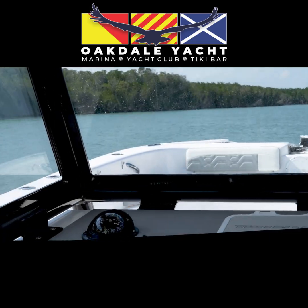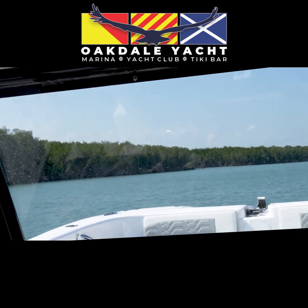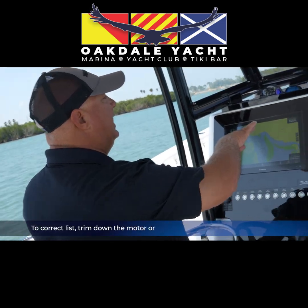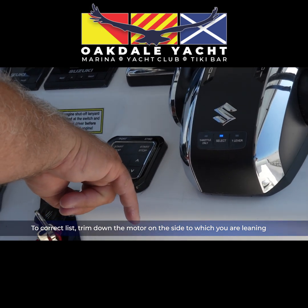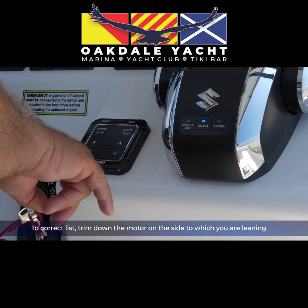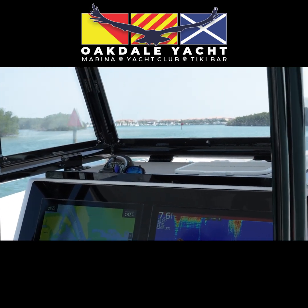If you find that your boat has a slight list to the port because you say have extra people on that side or extra weight, we're leaning towards the port side or left side. The way you're going to fix that is by trimming down on that port motor to level it out. And then I'm going to trim the motors both back up to get that nice optimal ride again.